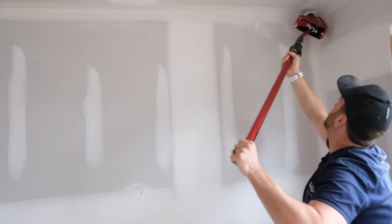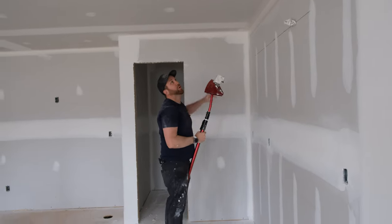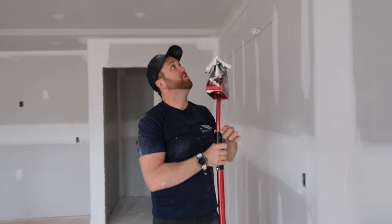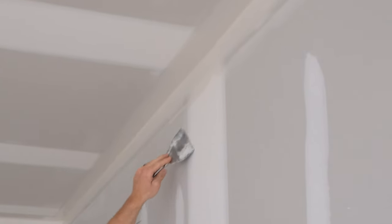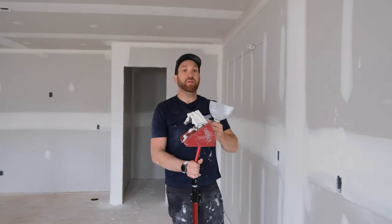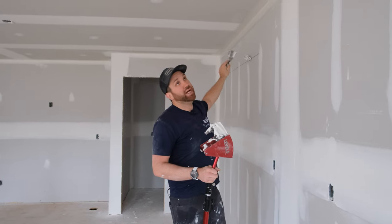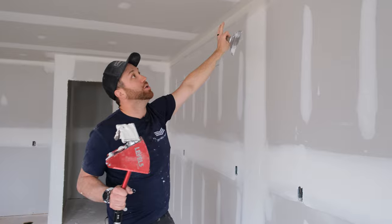I like to do two passes — I'll go one direction and then come back a second direction. There we go, we just did that corner right across. You can see I've got a little bit of overspill — that's acceptable because I can just give that a quick clean with my knife. This is one of the cons to having very thin mud: if your mud is very thin you're going to push it out more and get extra overspill. Along this run we've got a nice finished angle.